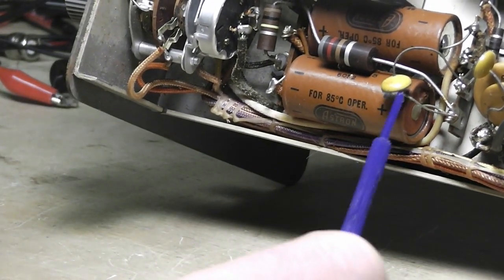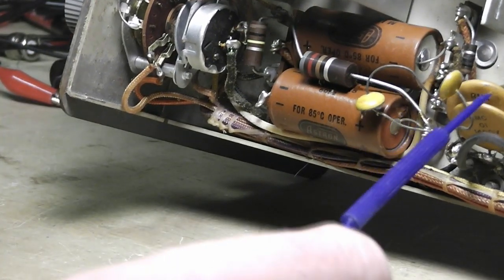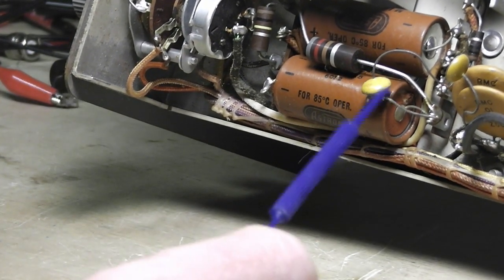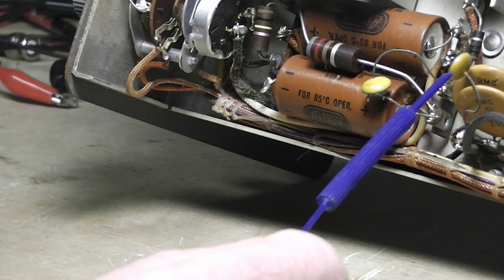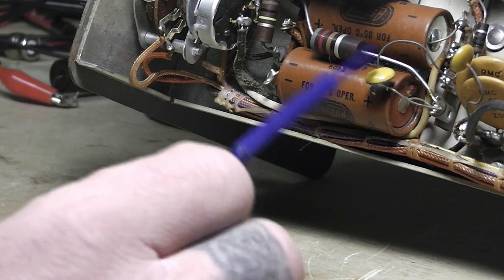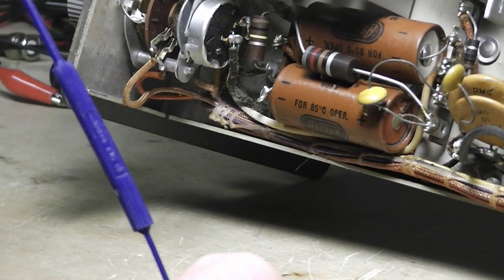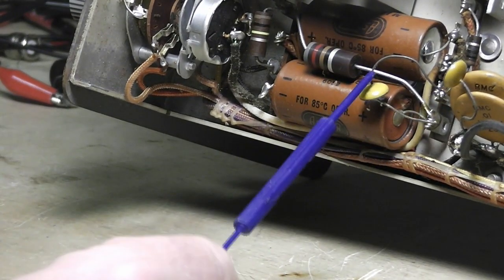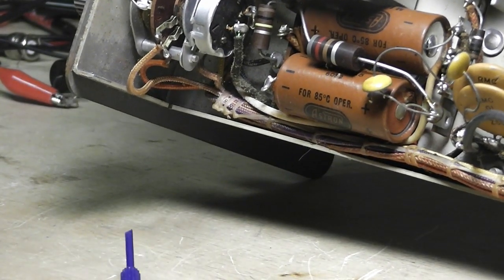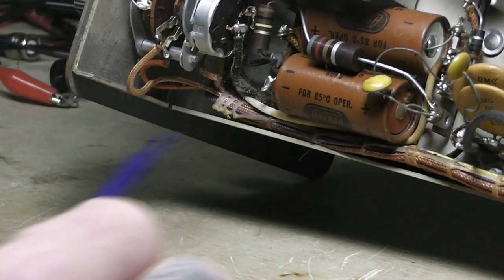And now these diodes here, these are them older diodes. They're probably fine, but I'll replace those with, like, my favorite 1N4007 or something, or 4005, whatever. But I'll just go ahead and replace those just in case, it don't hurt while I'm in here.